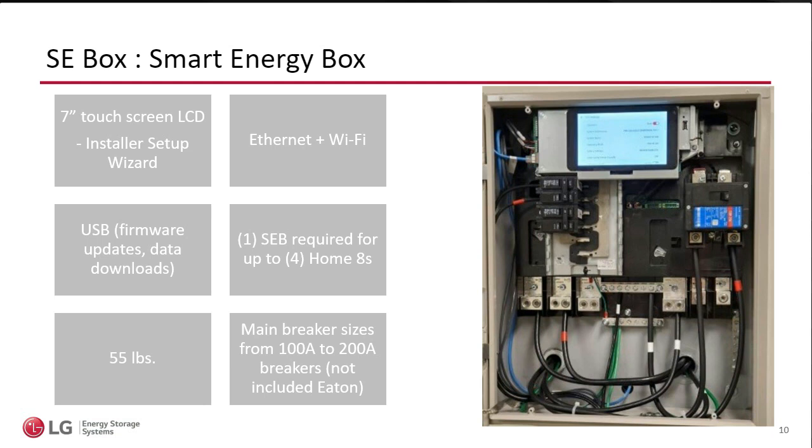Now, here's another thing that I've heard, and perhaps some of you in the audience who are installing ESS might confirm. In some cases, you get ESSs installed that are not functional unless you do a firmware update. They just simply are not going to create a sine wave, voltage, and frequency until you do a firmware update. That is not true with our unit.